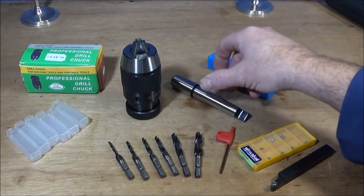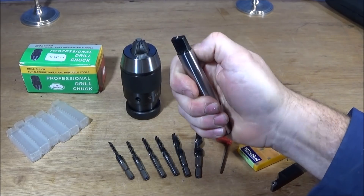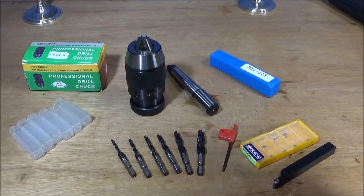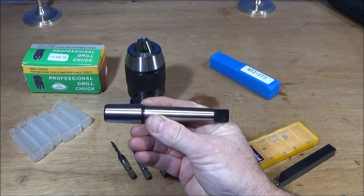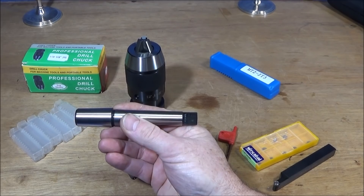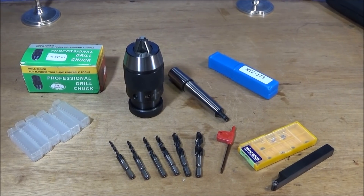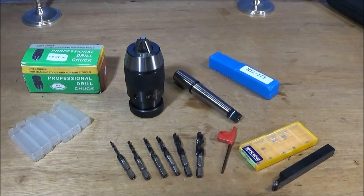If you've just bought a Chinese mini lathe or you're new to machining on the mini lathe, when you get these arbors you want to actually cut the tang off the back here and maybe a little bit more of the taper. That will give you much more travel on the tailstock barrel movement. If you've ever tried to put one of these long 2MT tapers in the Chinese mini lathe tailstock, you have to wind the barrel out quite a way before it'll actually seat, and when you wind the tailstock barrel back if it's not cut off you'll find it ejects the tool much quicker. I'll show you exactly how much to take off to gain the maximum travel.